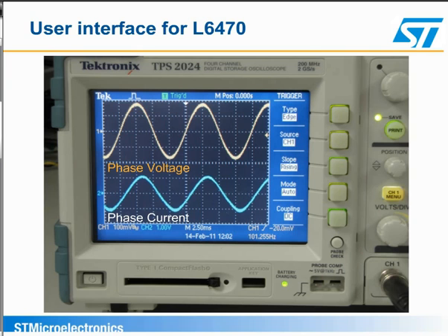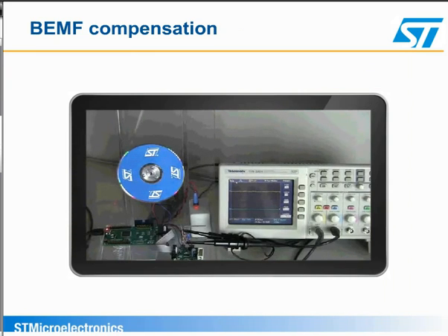Now, let's take a look at the back EMF compensation. First, we set up the system so that the BEMF compensation is zero. This is done by setting the registers that control the slope of the BEMF compensation to zero. This keeps the applied voltage constant over the operating range. Scope channel 2 shows the current and channel 1 shows the applied voltage. With no back EMF compensation, we see the variation of current as the speed increases. If we trigger the scope at the start of a movement, we see the applied voltage and phase current as the motor accelerates. We can see that if the applied voltage remains constant, the current decreases with speed. Since the torque is directly proportional to the current, you can see that the torque is significantly reduced in this operating mode.